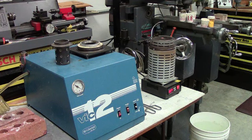At that point, if all goes well, I will continue to work by taking another flask out of the oven and repeating the process. If all goes well, I'll just leave the camera running. I have enough molten metal in the furnace to pour three flasks, and we might have to pause at one point to let the metal get back up to temperature, because when you pour it and put the crucible back in, it cools down. With that said, because there's so much going on and it's so quick, it will be a silent pour, unless I can manage a word in here or there, but typically it's just going to be a visual recording from this point on.